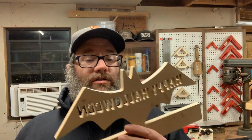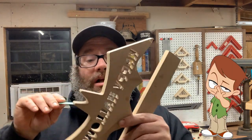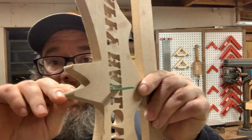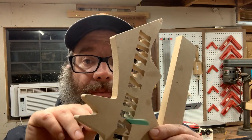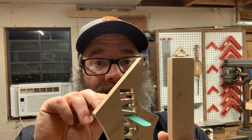Since I just mentioned health and beauty, let's start there. If you read the comments on the previous dollar store video you would have seen this mentioned a few times: emery boards. You get like 20 of them for a dollar, and what I use them for — especially with my CNC machine — is getting into places where I just can't fit my sanding tools. These work fantastic for tabs: when you use a CNC machine you have little tabs with a small bump, and you want to file that down. Great for small projects where sandpaper or a chisel would be overkill.